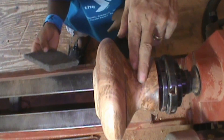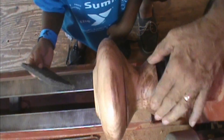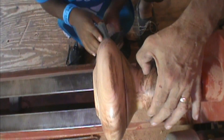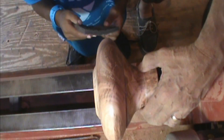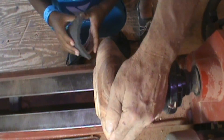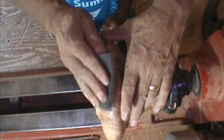I can see a white line here, which shows that the sanding is a little bit different between the two areas. But that's not anything he did wrong — you can't fix that with this sander; I'd have to re-sand it with the bigger setup. Let me just rub this a little bit.